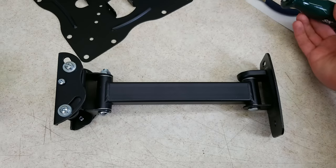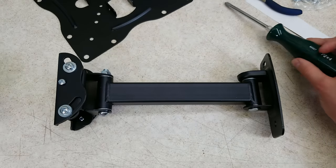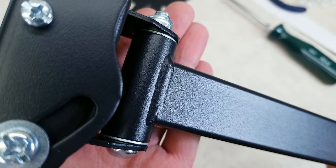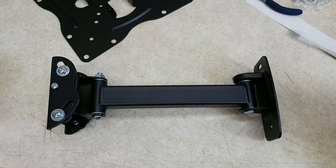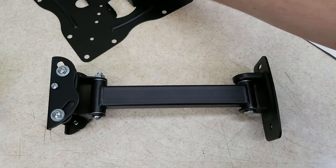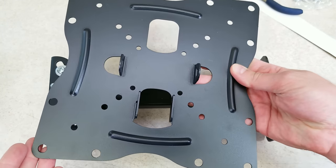When I opened the first one of these I had, I was actually pretty impressed with the construction. We have decently beefy square tubing here. It's welded at these connections on the joints, and if we look in there we can see it's actually a pretty clean welding job as well. The plates on the end pieces are all stamped steel and they're decently thick — I measured them and they're between two and a half or three millimeters, depending on where you measure.